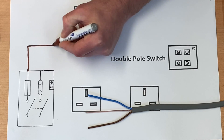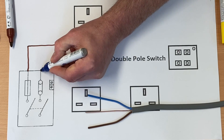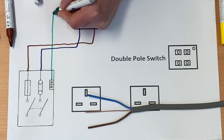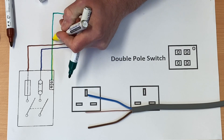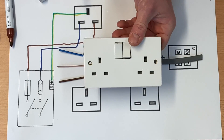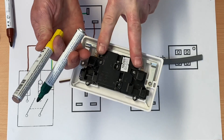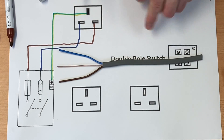So our line conductor - this is going to look a little messy because I'll keep crossing my conductors over as I go. We've got our line conductor, our neutral conductor, and our CPC coming out of the earth bar itself. I like to just strike it yellow to make it look like a CPC. That's our first 2.5mm² cable from the consumer unit to socket number one. Matt's likely to have chosen twin socket outlets. In this one, line here, neutral, and there are two CPC terminations. He could have done two or three sockets before going through the double pole switch.